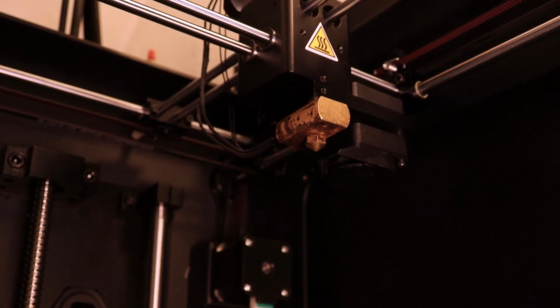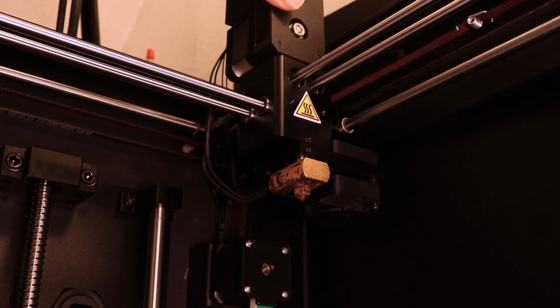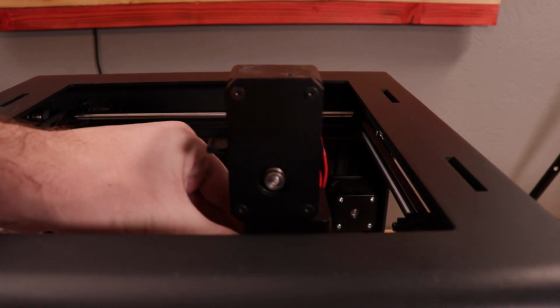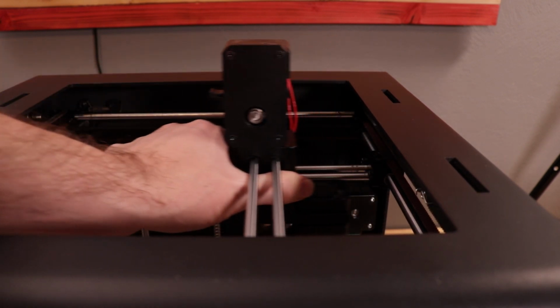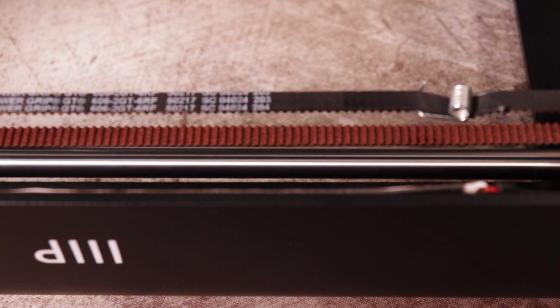That's because the block is solid aluminum and the bearings are mounted to a sturdy case that's never going to give. Everything is just so rigid nothing can give and it just locks up. If you know which bearing is out of alignment, this isn't too hard to fix, but if you're just guessing, you can really end up making things worse. Everything is relative to everything else, so it's kind of a nightmare getting it all lined up. What makes the problem worse is that you can't repair the gantry without totally disassembling it. If you have a bad bearing or a bent rod, the whole thing has to come apart.